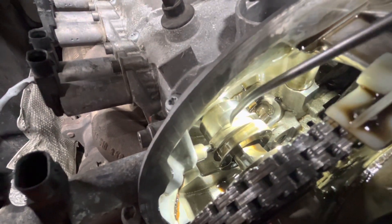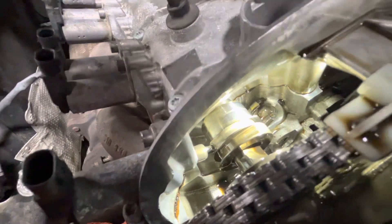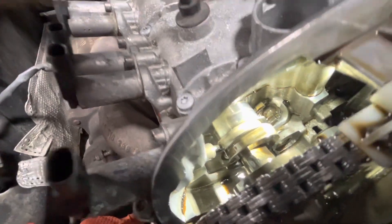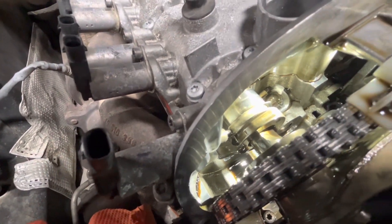The other solenoid is kind of limp at that time, and then the opposite thing happens — the ramp is in the opposite direction, so that one shoots out and pushes the collar back the other way. It's all done at the back side of the cam, and the other side of this has the lobes. That's how it's done.